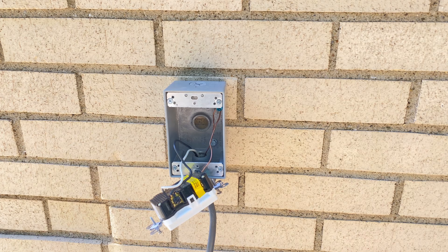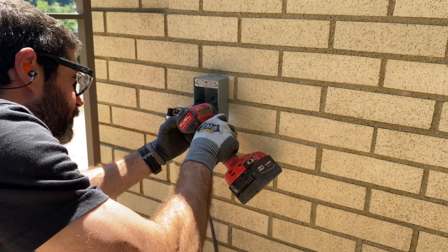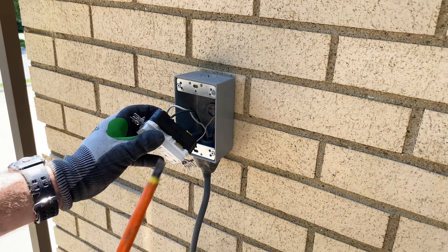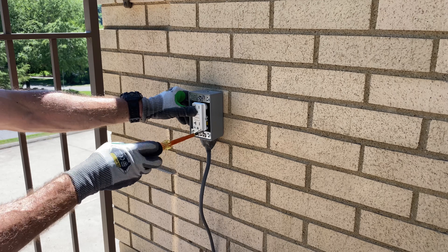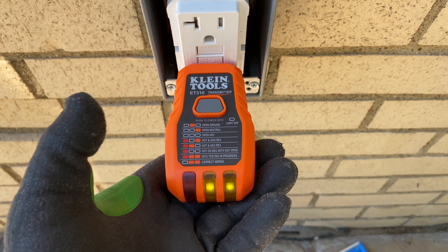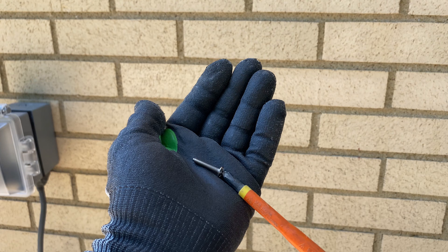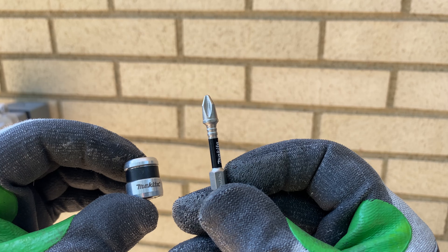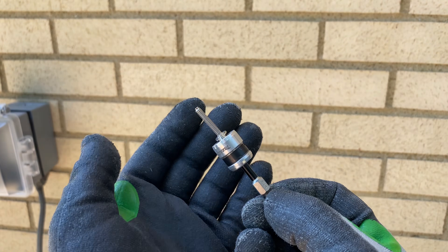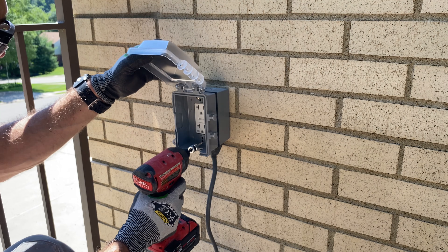I accidentally forgot to add a plug to the back, so I had to pull the box off the wall, do that, and reconnect it to make sure it was nice and secure. Then I used electrical tape and wrapped that around all the electrical connections, secured the GFCI to the box, and made sure it was wired correctly. I added the weather-resistant cover — it has a foam gasket. Pro tip: if you have trouble keeping a screw on your screwdriver, use a MagBoost connector with a number two Phillips head — it keeps the screw on your impact driver or drill.